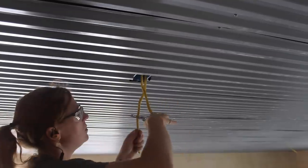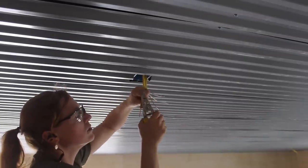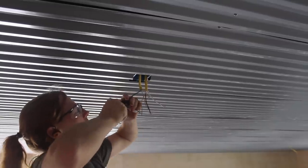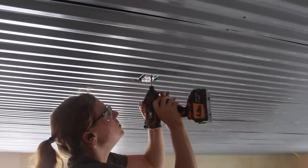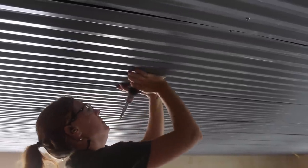I've been so amped up about the lights. I'll have nine lights in the woodworking side and six in the metalworking side. I have a gang box at every planned light fixture and started by wiring in the plugs for each one. Having an outlet at every light fixture will also give me flexibility for mounting cord reels so that I can have them drop down from the ceiling.